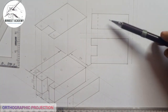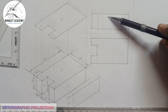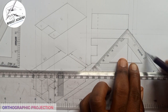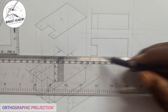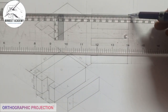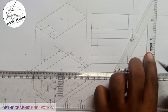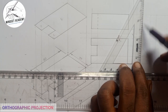The plan is always under the front elevation. If it's in third angle, the plan will be on top and the front elevation will be down — that is the difference. Now I will use my 45-degree set square to draw an inclined line from the point where the X and Y axis meet. Then I'll project all these points to touch that line — this point, this point, this point, this point. I'll now project all these points upward to touch the corresponding intersections.